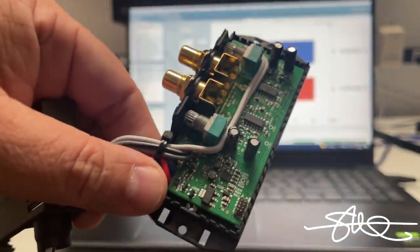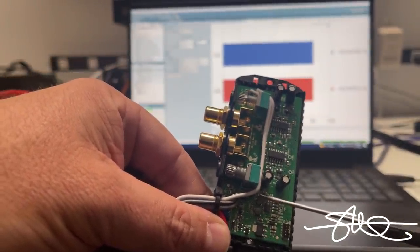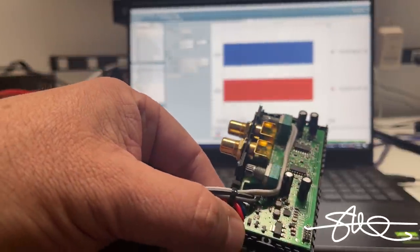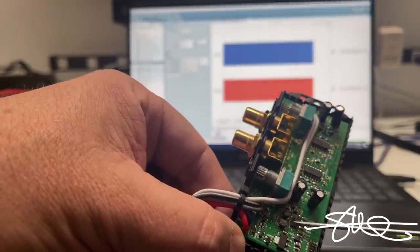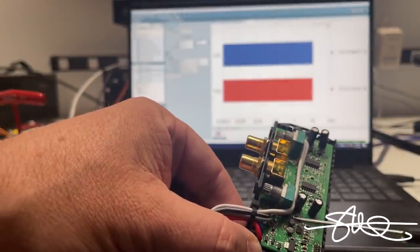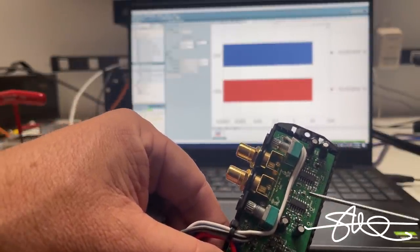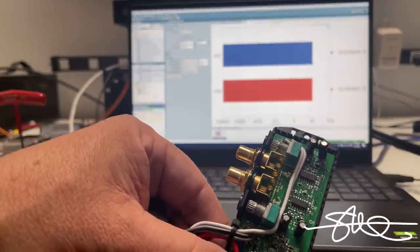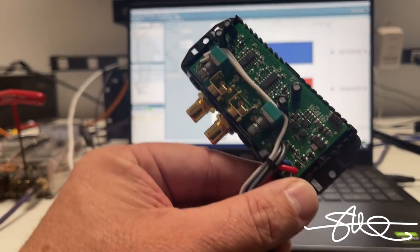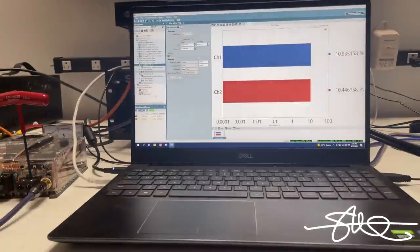It's got a power supply of its own right here. Here are the power supply transformers - one, two. This is a military grade power supply. This is the voltage regulator here. This is the switching controller. This is a 30 volt supply. These are Burr Brown low noise quad op-amps - four amplifiers in here, and another four. They have gain circuits and filtering and other things. It's not just a box with a transformer. Let's actually run this thing. Anyway guys, that's why they cost more - there's actually stuff in them. We're not just trying to rip people off.